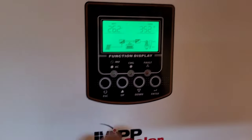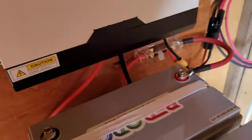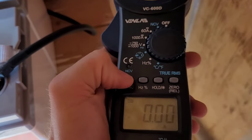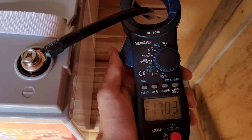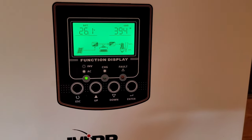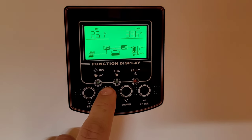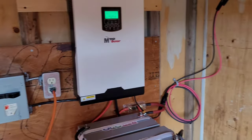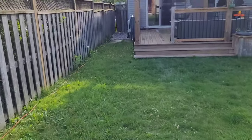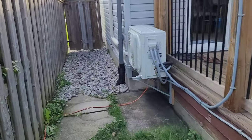The AC is coming up to speed. Looks like we're pulling around 350 watts, 11 amps off the battery side. The solar is making up for the rest of it at this moment. No weird sounds, no weird smells. We're doing about 17 amps off the battery — some of that is accounting for the actual load of the inverter and its inefficiency. Coming up to almost 400 watts. This is going to be a big improvement over my little 1000-watt — that thing did actually trip a couple times when I was trying to run the AC, especially when clouds would come out. So this will be a big improvement.